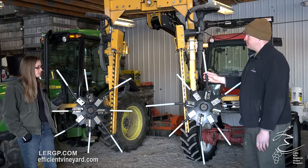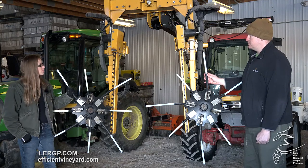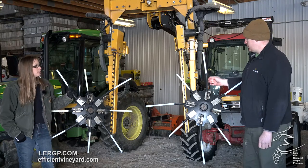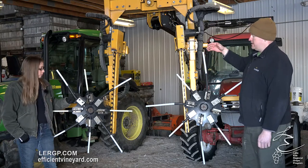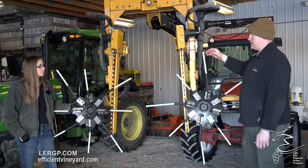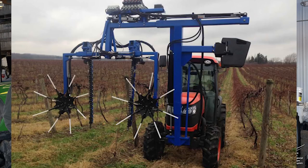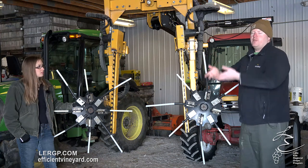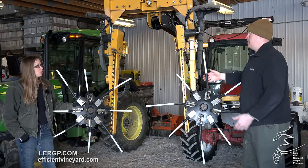What other types of machine designs are out there? This looks a lot like the Laporte machine that's commercially available. That's correct — it stemmed from the Friday machine in Michigan with a comber. So you've got this machine that has that comber style, and the Joy machine which has the same style comber on it. They're all a sickle bar that was then modified to a comber to help pick up those canes and move them out into the cutters.